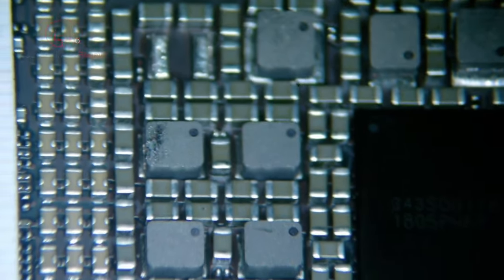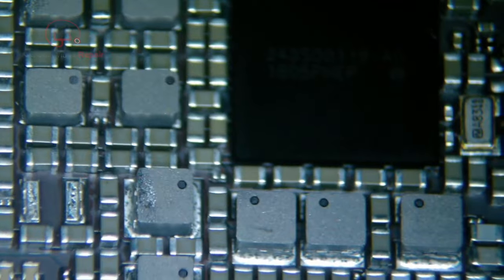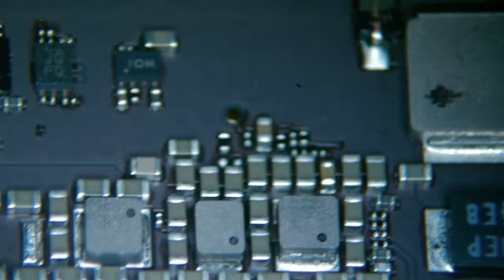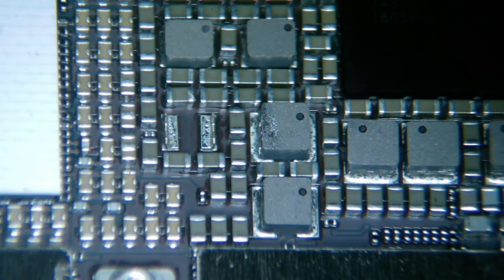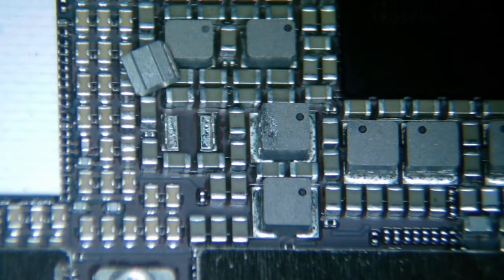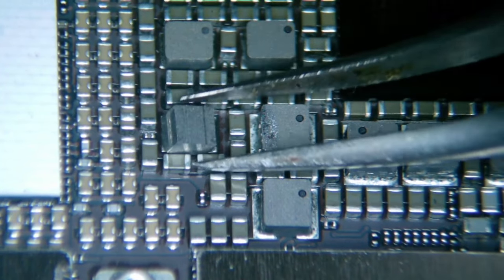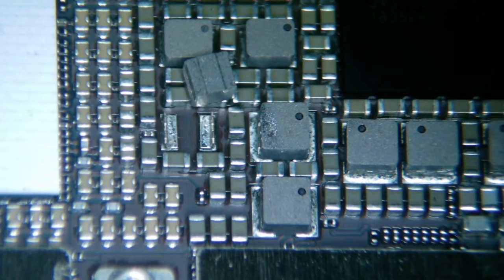Do keep an eye out for that if you happen to open one of these up. I actually found one of them rolling around inside of the housing. This is one of the missing coils, and when we flip it over you'll see it is broken away from the connection that sits on the bottom of it, so there's really no way to reattach this — that's going in the trash. We'll have to remove those little mounting brackets and replace these completely.